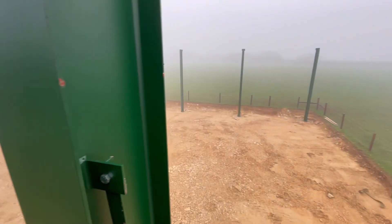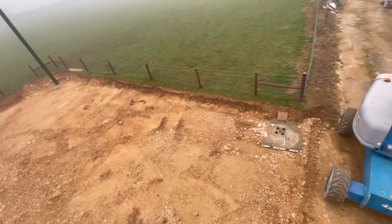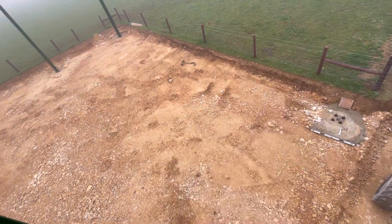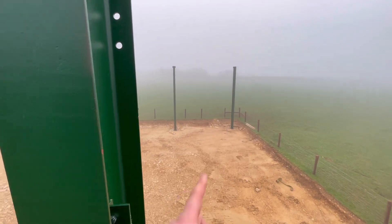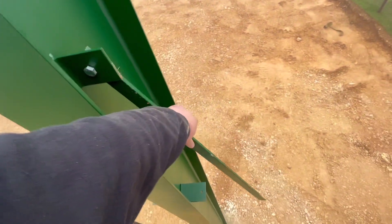All the posts are up - I'm just putting these bars on just here. Next thing we're going to do is put the wood in. I've had to take that post down because I've welded one of the cleats on that side instead of this side - typical schoolboy error. It'll be back up in a minute, then we'll put the wood across just here to support it, with the wind bracing in just there, and then we'll start putting the rafters in.